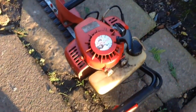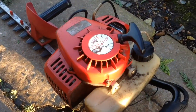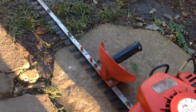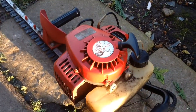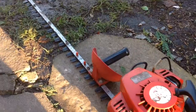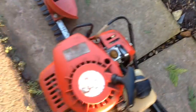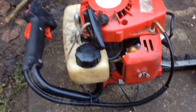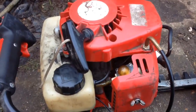The Mantis is up and running now. I'll give it a try out — it seems to be okay. I'll adjust the fuel a little bit and the blades could do with a slight sharpening. I know it's done and it seems to run well. I've got a slight fuel leak from there — I'll replace that pipe. But it's running well now, so the diaphragm did do the job. I will sharpen the blades, and I've run out of the yellow fuel pipe that I need, so I'll have to get some of that. But that'll be the final jobs on that.